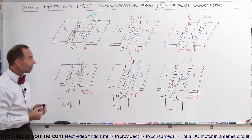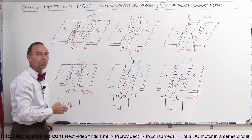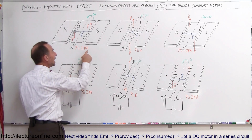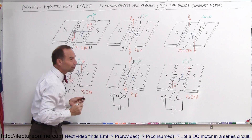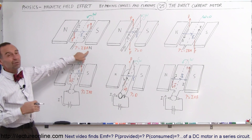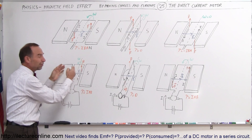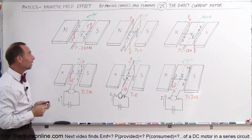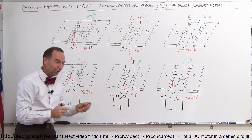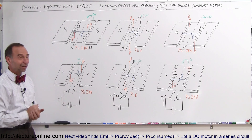To make it more effective, DC motors typically don't have a single loop of wire — they have multiple loops, 500 or 1,000 loops, to really amplify the effect. The torque is equal to I times B times A times the number of loops, so if you want a stronger torque — a greater driving force to turn the motor — you simply need more loops. Making the motor bigger with a larger cross-sectional area helps as well. The simple device where the current switches every half turn is what makes a DC motor possible, and that's how they work.